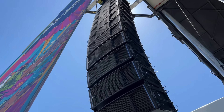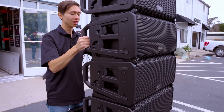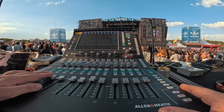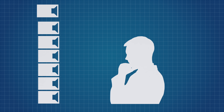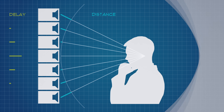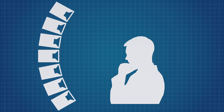In the wild, you'll typically spot these at concerts, either flown in a J arrangement or even ground stacked to cover a smaller venue, with output somewhere in the neighborhood of 100 Hz through 20 kHz. And while using a long-throw loudspeaker array in the near field may seem a tad misguided, you can phase the individual drivers to focus on a single point, either by delaying the signal by the inverse of the distance to the listener, or by physically arranging the speakers into an arc around the listener.